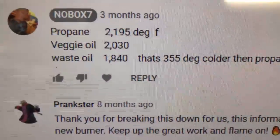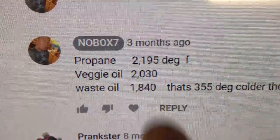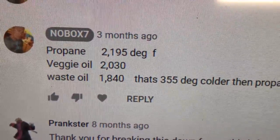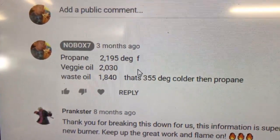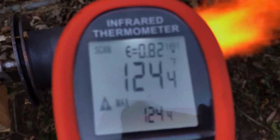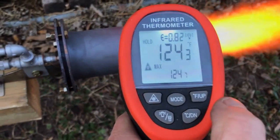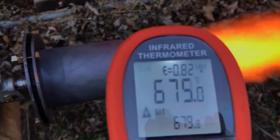These are some figures that are more typical. One thing I want to point out about propane — this is not the temperature you will get off a propane torch. You'll only get about 1900 to 2000 degrees off of a regular propane torch of any kind that isn't air-assist. Here's a thermal gun I got that goes over 1000 degrees. I'll leave a link in the description because they're kind of hard to find at a good price. I don't know how accurate it is, but it definitely allows you to measure the temperature of things over 1000 degrees.